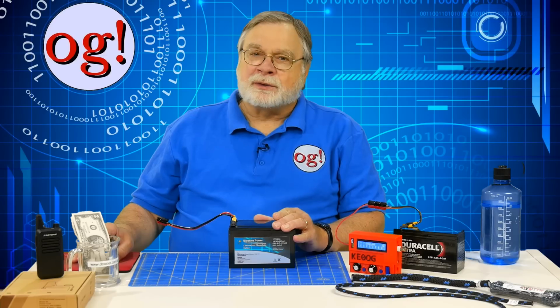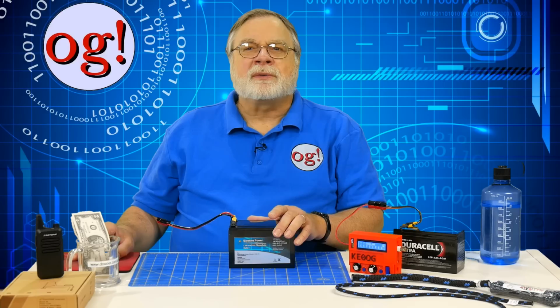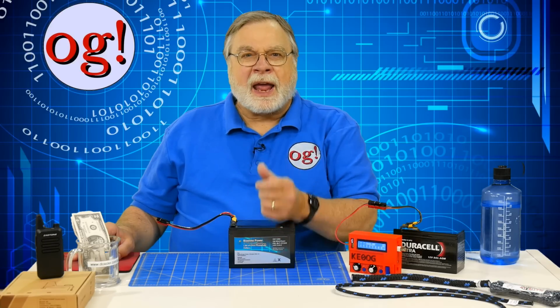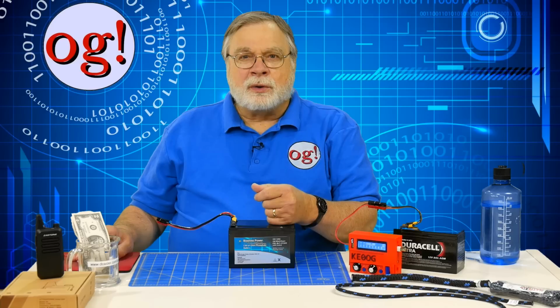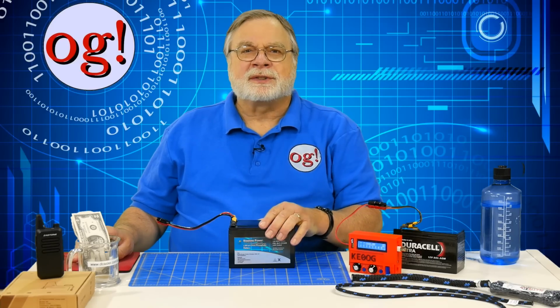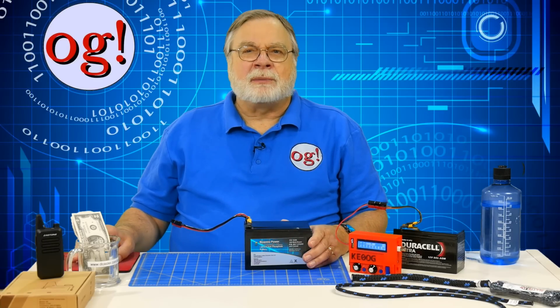The lamp takes about 120 milliamps, so we're talking 96 hours at 120 milliamps on average for 11.52 amp hours consumed out of a 12 amp hour battery. Not bad at all. Note that's 96 straight hours of operating. In real operations, such as high country backpacking, you wouldn't use the light that much.